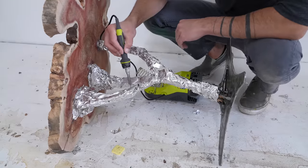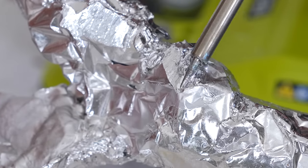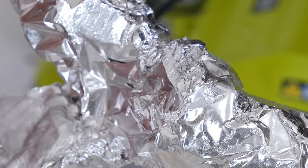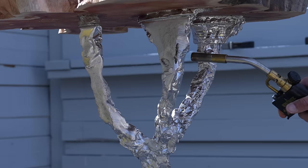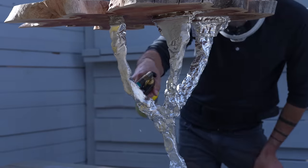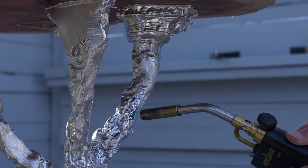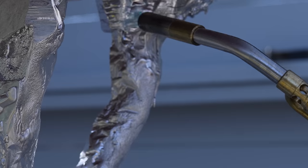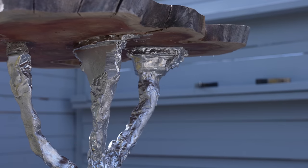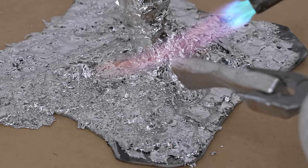This project was also the first time I got to test out my Ryobi soldering iron. It works really well for melting down some of the facets into a more organic texture, and you can even cut off pieces of tin to recycle them. A really fast way to thin down the overly thick parts was a torch, which gave it a smooth tree-bark-like texture. In thinning out the upper branches, the droplets dripping down started to coat the base and it looked very much like a mossy, rough-textured lower part of a tree trunk. So I decided to go with this and just held some tin in pliers, melting and dripping it all over the base.